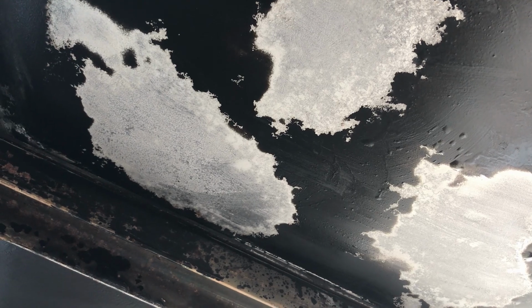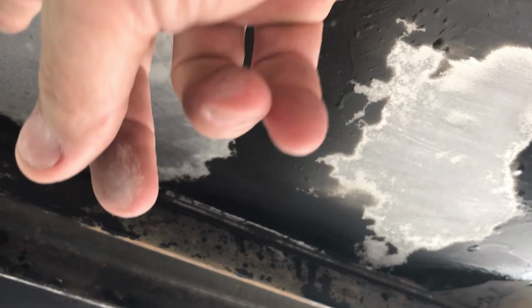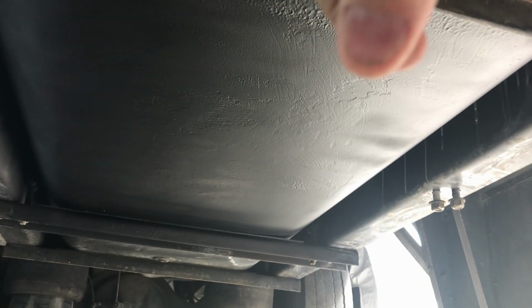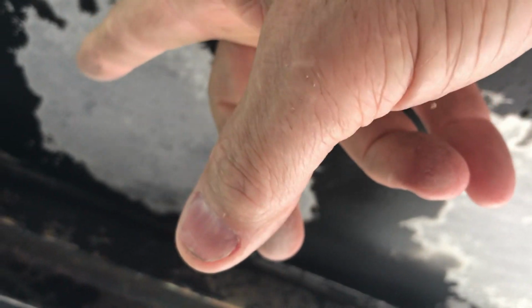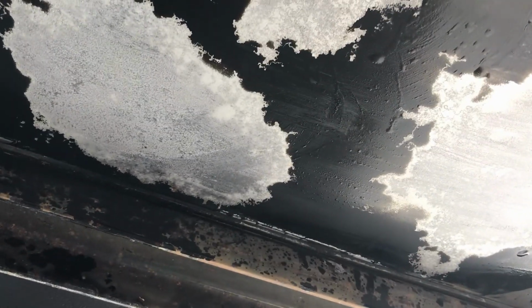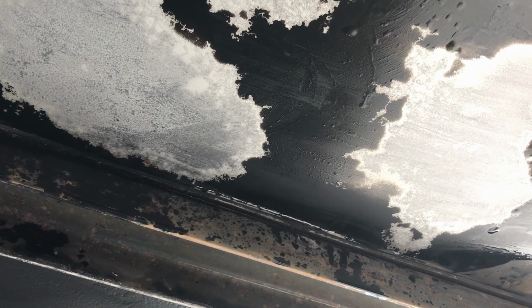And the step that I didn't do last time, I'm going to sand it one more time, because this is galvanized, and the galvanized kind of bubbles up. It eats up the galvanized, and I think that was why the paint on the other side failed. I'm going to sand the fuzzy white stuff off. Then I'm going to wipe it down with lacquer thinner again, and then shoot it with the undercoat. So that's what's going on today.